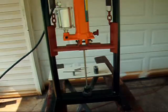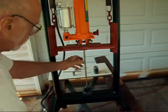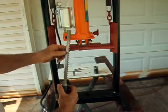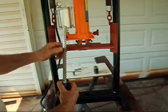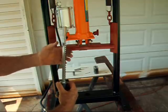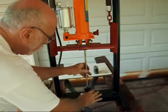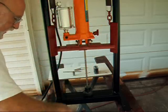Alright, we've got this set up here. We're going to connect the air for it. Basically the broach is like a straight saw — each one of these teeth is slightly further out, and when you push it down through there, each one is going to carve off a piece of metal. It fits in there like that. Place it over the hole. Tighten your valve up.